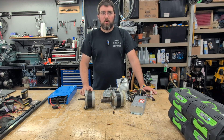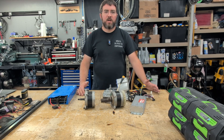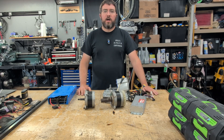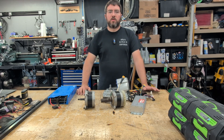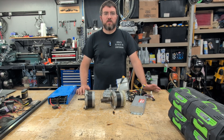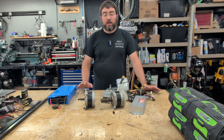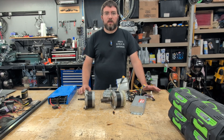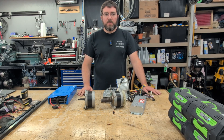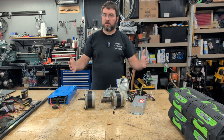I realize it might be a little boring just watching a slideshow. Kind of like Mitch, I used to fix mowers on the side — I still do. Several years ago, one of my friends ended up buying one of the Ryobi 54-inch zero turn electric mowers. When I checked it out, I couldn't believe how much of a toy the whole thing was, other than the fabricated deck which was the only solid piece on it. And all that for almost six grand. The mower blades are wafer thin and it had lead acid batteries that people don't cycle correctly, because lead acid can only be cycled down to 50% to maintain your capacity.